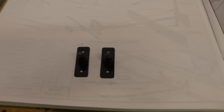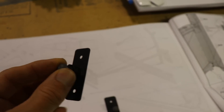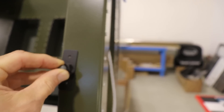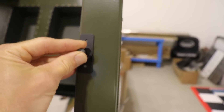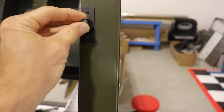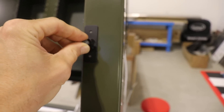Since I'm putting those on, I wanted to get my door mounts ready. Yesterday I rounded the corners on all these pieces on my grinder so they're not a 90-degree corner, then primed and painted them. I drilled the first hole, marked the second with a sharpie, then drilled both holes. I wanted to get these drilled before installing the green channels, because once those are on you can't get to the holes to mark them. Now these are primed, painted, and ready to rivet on.